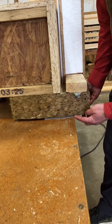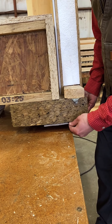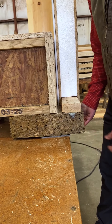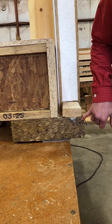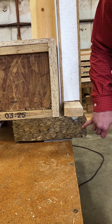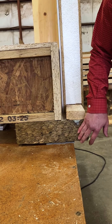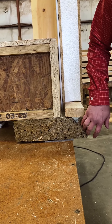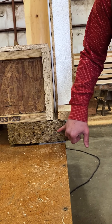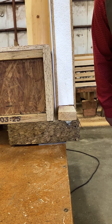This is the sill seal we really like — it has a self-adhesive backing so it bonds to the sill plate, and it's very thick at three-eighths of an inch. The sill plate we like to use is this PSL, parallel strand lumber, made from small strands cut from the tree. The imperfections of a typical tree are engineered out because those little strands are glued back together, and they are also individually pressure treated, so you have very good pressure treatment that runs all the way through the timber.